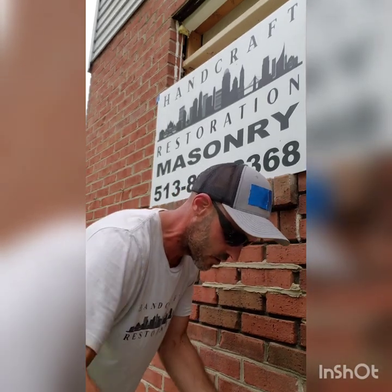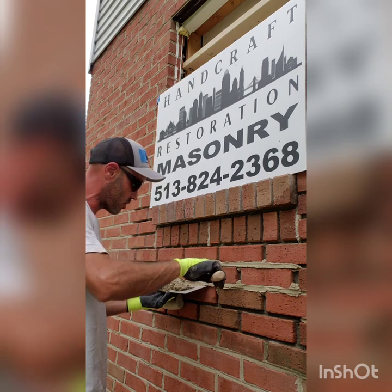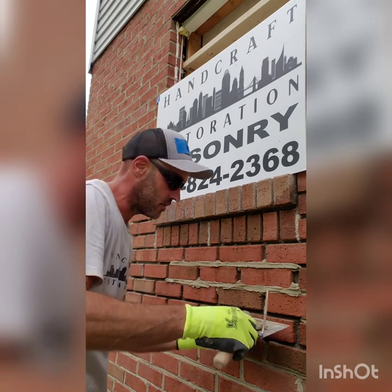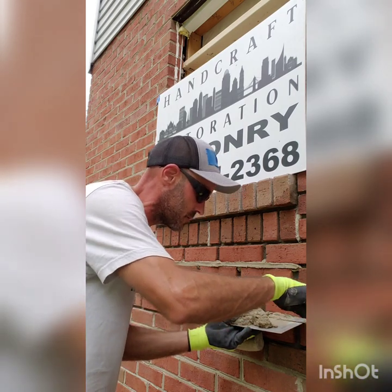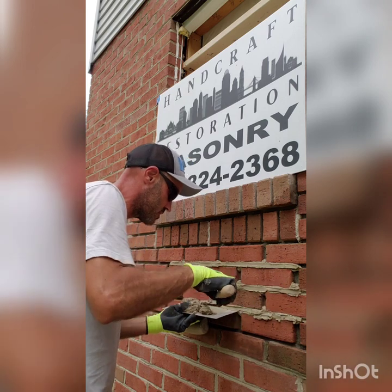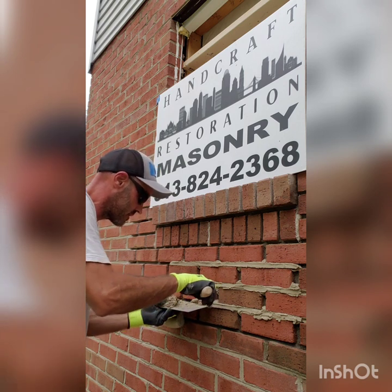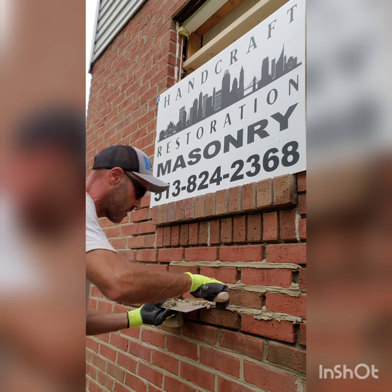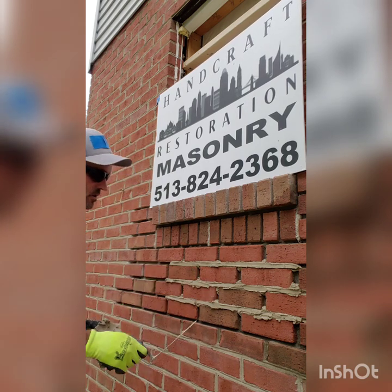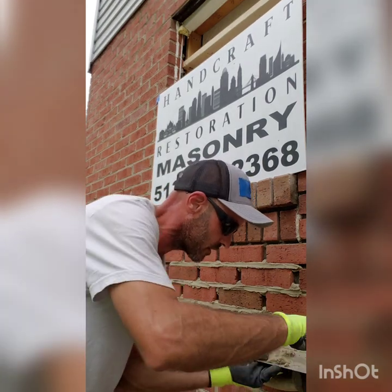You can put as much mortar on your board as you want — it's just easier to start with a smaller amount while you get the technique down. Some people say your hawk board or trowel should never touch the wall; I don't agree with that either. You just have to figure out the technique of how to keep from making a huge mess, because that's the biggest complaint with that. You want to make sure you're pushing your mud all the way back, because when it comes time to joint it out later, we don't want any voids back there — we want it jam-packed. I always want to leave more mortar in the joint than I need; it's called leaving it proud. That way I'll have a little bit of excess mortar to play with when it comes time to joint it out.